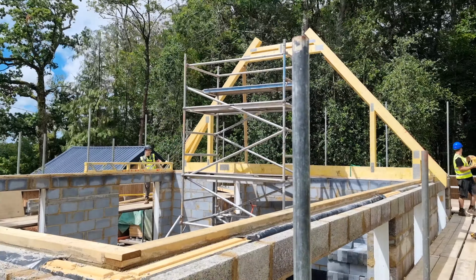So we've landed the big truss here, and that's the second of 3. The third one goes virtually next to it, okay, so that'll be fairly straightforward. So what I did there is I formed a couple of braces, okay, which were exactly parallel to the bottom, all of our datum effectively. All I had to do was literally slot it on because I've blocked it in between to hold them dead parallel up there. It's a bit bright there, but you can see that.